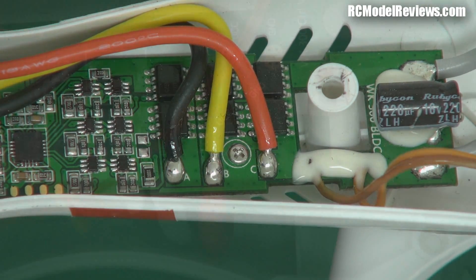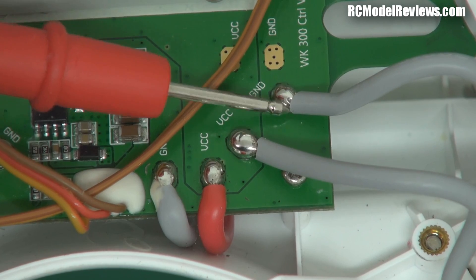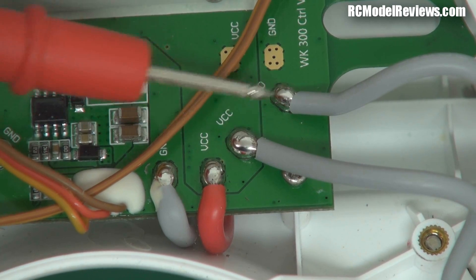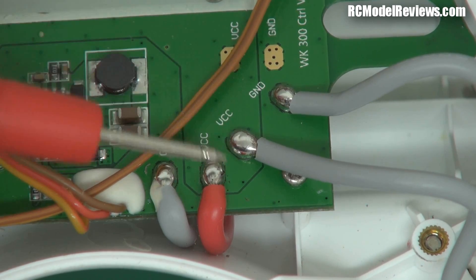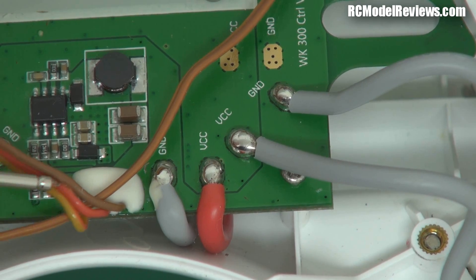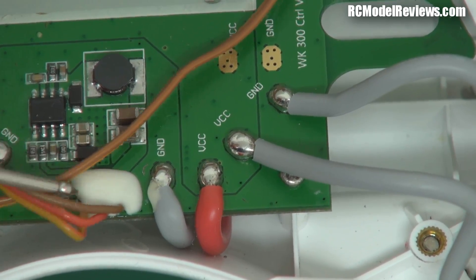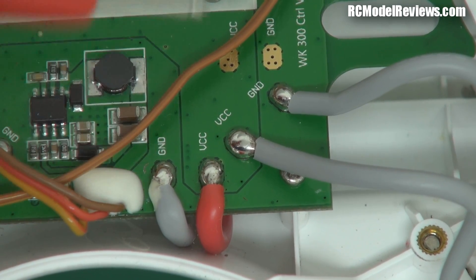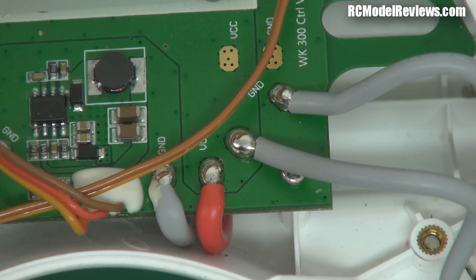That's the way it should look. And again on the main power distribution board, the soldering here is really good. The insulation comes right up to the solder ball, it's nice bright solder, there's no mess everywhere, no little jagged edges poking out because they've overheated the solder. It's really quite good. And again down here, some silicone to protect the wire from bending and stretching and causing the solder joints to break off. This is quality stuff - this is what you would expect from a unit costing several hundred dollars.